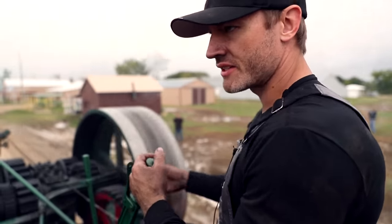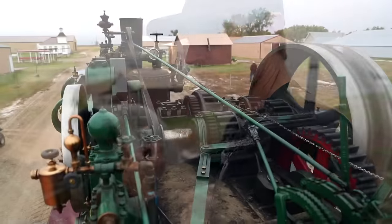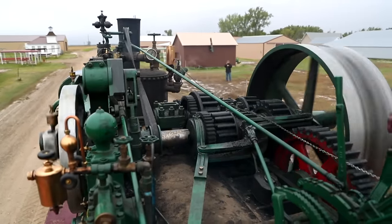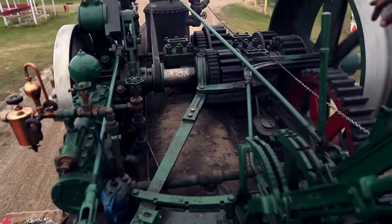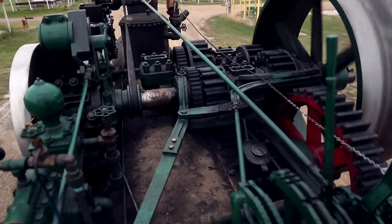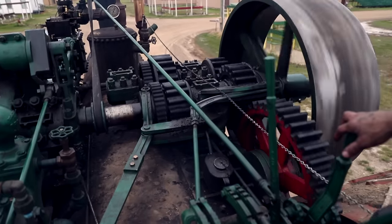This engine was designed as a road locomotive for heavy freighting — pulling large loads over long distances. They actually designed it to be two-speed. Most steam engines are designed around the walking speed of a horse, but this engine will run five and a half miles an hour in high gear. They achieved that two-speed by designing an auxiliary transmission. With the clutch engaged, the flywheel and clutch are engaged and power goes directly from the crankshaft to the intermediate gear — that's high gear at five and a half miles an hour top speed.